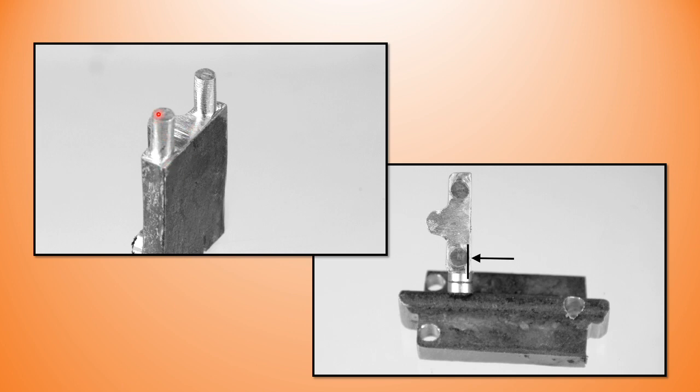As I've shown here, this is what not to do, I've got my tenon centered on the backstrap material. What does that do for me? Well, certainly it's very centered. I've got a shoulder here on the back and I've got a shoulder here on the front. Don't forget that other bit of collar material, the bit that's going to go here with the mortise in it. This is why I had that very thin mortise wall.